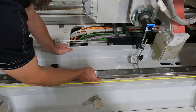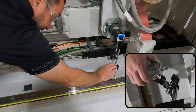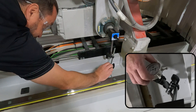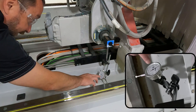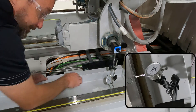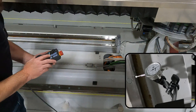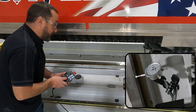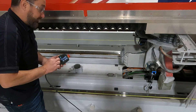You want to be on the top side, and then once you have that, we are going to zero out our dial indicator. We are on number four here on our small dial indicator — at zero and four. We are going to drive our Y-axis down and see how far out it is. As we are driving down, we just want to watch that dial indicator to make sure that it does not fall off of that flat edge.